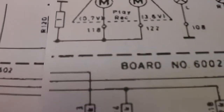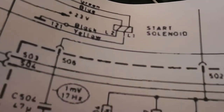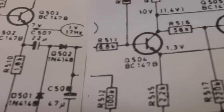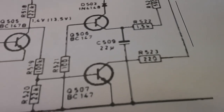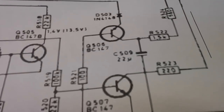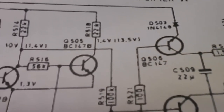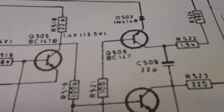Let's have a look at what I'm looking at here. This is the old style board - the fast forward and rewind motors have a 1-ohm resistor to ground which feeds into this amplifier. There should be a 1-volt 17Hz signal, though it depends on the speed of the reel. Then there's a voltage doubler that feeds this Schmitt trigger, then an output transistor. When that's on, it pulls the voltage down to the voltage regulator supplying the motors and the hold solenoid. Transistor Q506 with the diode in the emitter appears to be the speed control transistor, pulling voltage down to the regulator to slow the spool as it approaches the end on fast forward and rewind.